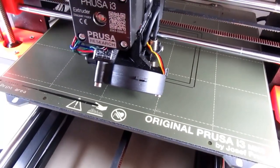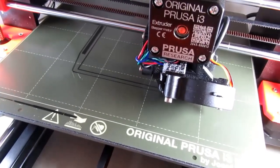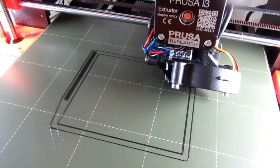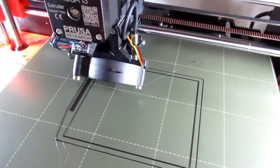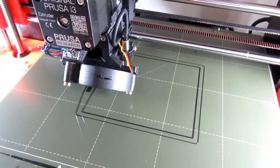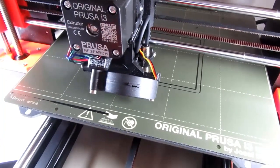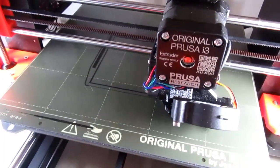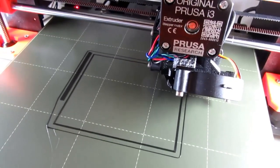Even though they agreed that my original layout was probably pretty good, considering my objective of having a minimum amount of support structure, they thought I might have stability issues with it because the main object was only being held up by a narrow wall and with a lot of overhang, and that might cause problems as the print progressed. So I'm trying it this way.